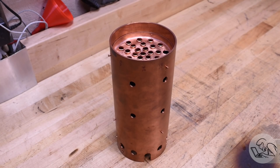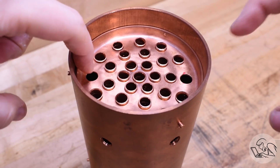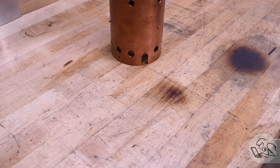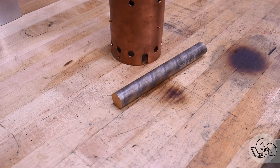Boiler bushings are critical because the boiler shell itself is not thick enough to carry threads. We've got four spots in the shell for the various fixtures, and then two holes on top for the steam output valves that go on this boiler. I'm going to make these bushings with phosphor bronze - I happen to have this chunk in the stockpile. It's quite a bit too large in diameter for what I need, but it's what I have so I'm going to use it.